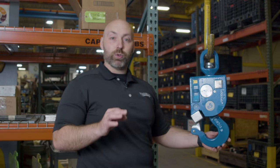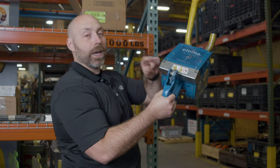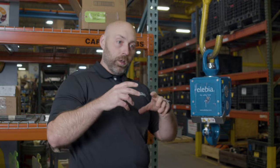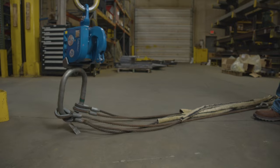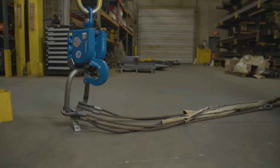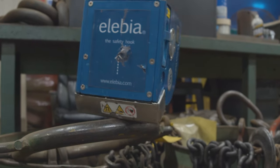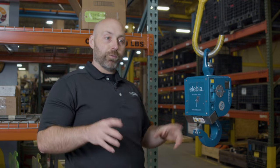Moving on down — one of the greatest features of this hook, I'm going to turn it here for you, is this magnet. What that will do is take your bail or your master ring on your sling and center and align it, so that when this hook closes you'll never have to have somebody make sure it's lining up. It eliminates all pinch points and eliminates anybody from being right next to the load — a really great setup for anybody that needs to be away from a load or is worried about somebody being in a very dangerous situation.